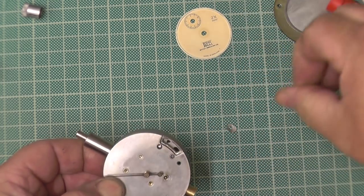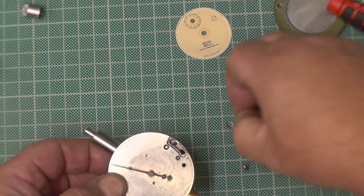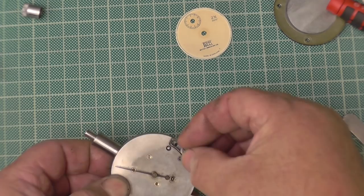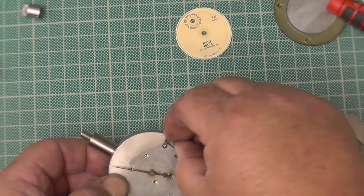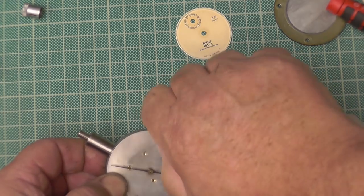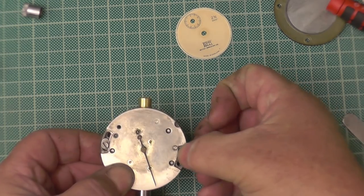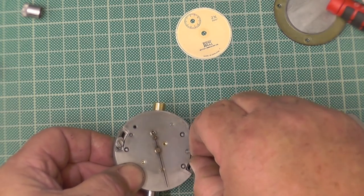Now there's 2 screws. These ones here with the washers. Now I usually turn the washers round because they usually get an indent. So you've got that turned tight against the rack now, that's why it's not moving. And obviously with them slotted holes you can adjust the fit of the rack on the pinion.